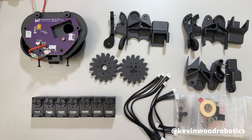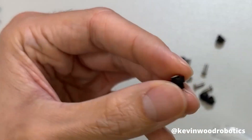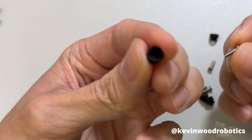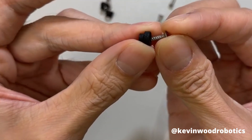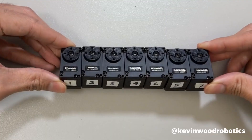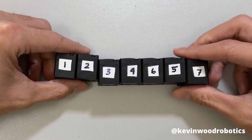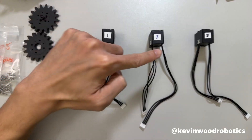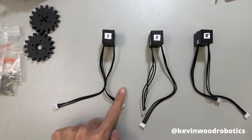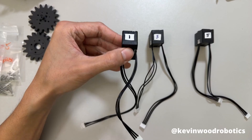I'll be using these parts to assemble the EN-02-OP robot hand from Westwood Robotics. First, we want to prepare the idler pulleys. The way it works is you have this rubber piece and you want to put the screw inside and push it all the way through. Take your actuators and make sure to label them 1 through 7 and set the IDs in the software. Taking the actuators with ID 1, 3, and 5, make sure to have the long, short, short-long, and short-long orientation. You can verify the orientation here so you don't mix up between your left and right.